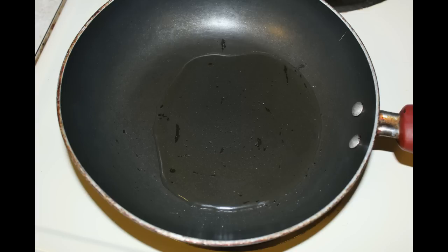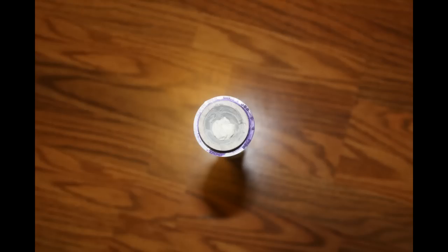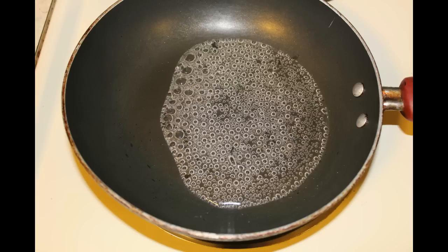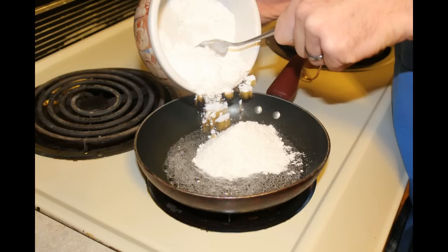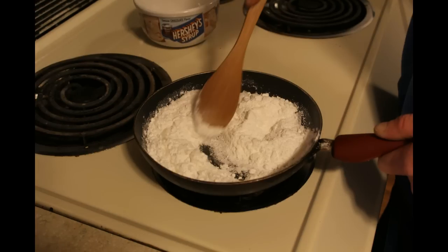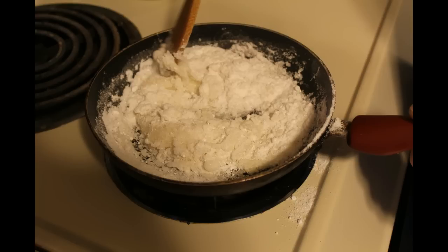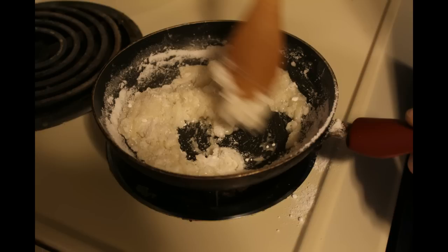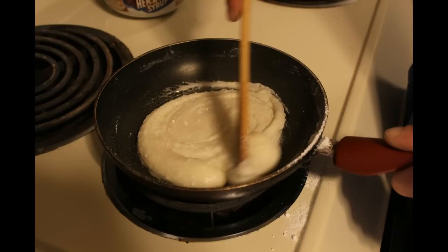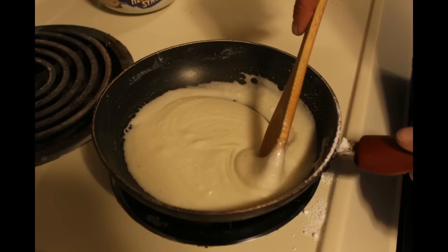The fuel inside the engine takes longer to harden up as the temperature can't escape as easily as if it was just sitting on the counter. I also put a healthy wad of paper towel in the nozzle throat to stop any fuel from dripping out. Mix the potassium nitrate and sugar together — make sure it's mixed very well. Put the corn syrup on the stove and let it heat up. Once there become some bubbles at the bottom, this is when you can add your fuel to the mix. Once you put it in the pan, keep mixing it — don't let it sit on the heat without being mixed, not because it's going to ignite, but you want a good even mixture and good temperature distribution. You don't want to create any hot spots. Once the fuel has become the consistency of yogurt, you're ready to pour your fuel into the engine.